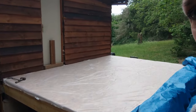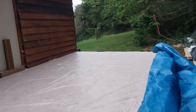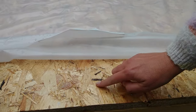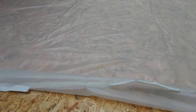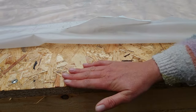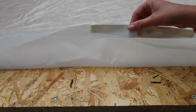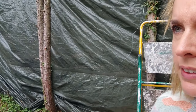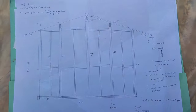I've covered this back section completely — we've had loads of thunderstorms so I've had to do a couple of things. One thing I wish I'd done at the very beginning is to cover the whole surface with a marine treatment for boats, which is not hugely expensive — about 40 euros for a big pot — and it gives a waterproof finish. It could do with another pot to be honest, but I'm going to keep it covered with plastic and a big thick tarp on top.